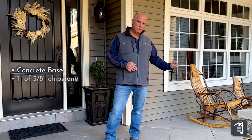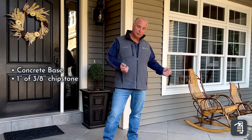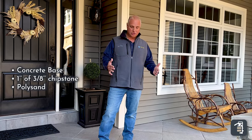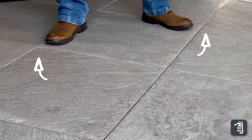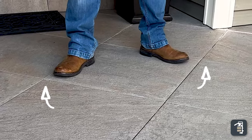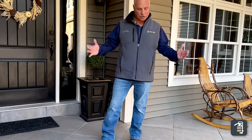When it comes to installation, we want to show you a video that we filmed right here about a year ago. This is eight years old, and originally when this was installed — this is a concrete base that has one inch of 3H chip stone — we laid the paver, or the porcelain, on top and then swept it in with polymeric sand. But within a couple years most all the polymeric sand had dissipated, and I credit a lot of that towards some of this movement. You can hear the rocking — all these pavers or the porcelain start to get unstable being such a large slab and being this thick without interlock.